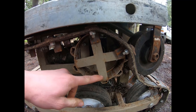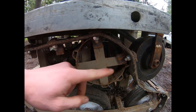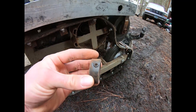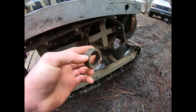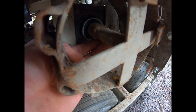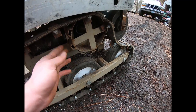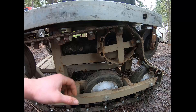To attach the sprocket to the motor, I first made an attachment point in the center using one-inch by one-eighth-inch flat bar going side to side, so I could weld a shaft to the center. To connect to the motor shaft I used two collars welded side by side with the set screws lined up — sized to the inside diameter of the wheelchair motor shaft. Then I welded a piece of half-inch water pipe centered as the shaft. This has been going strong for about a year and a half with no issues — just keep the set screws tight.